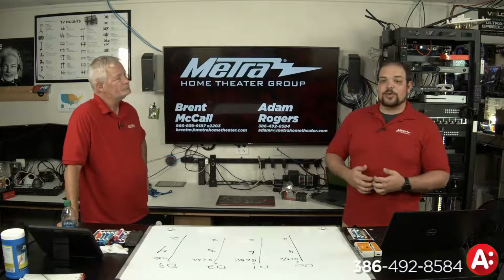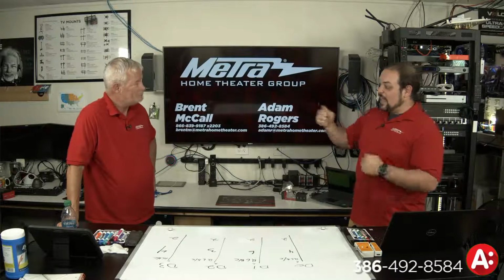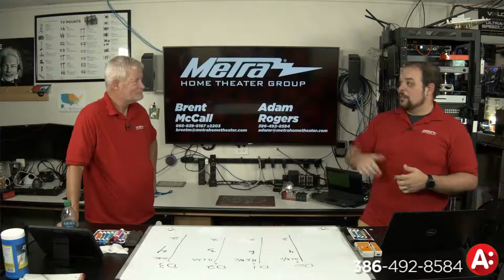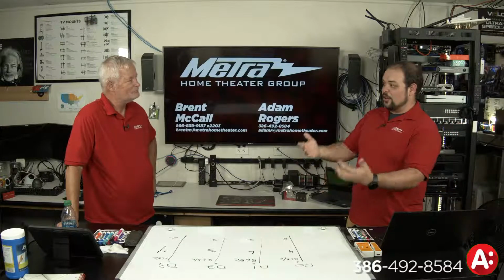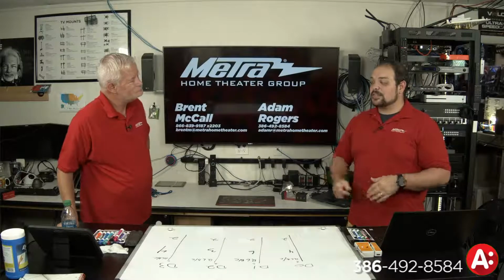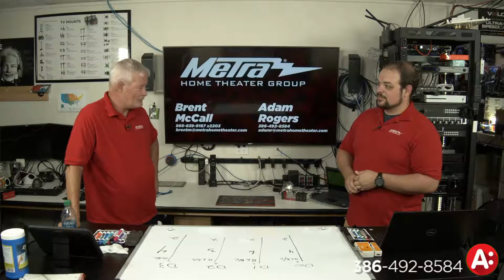Correct. So from there, what it's doing is saying that there is an Integra receiver in line on that connection. It found the TV for power, but for some reason it picked up an Integra audio system. When he bypasses the extender and goes directly to the TV, it works perfectly fine. So for whatever reason, our extender is saying Integra. And I have no idea why.